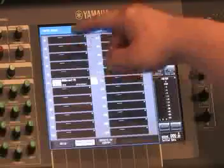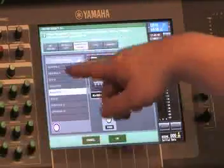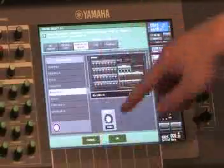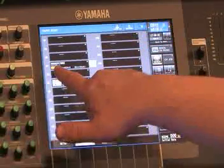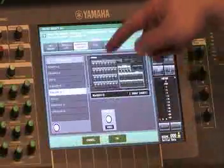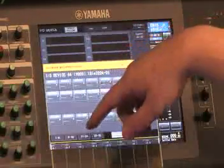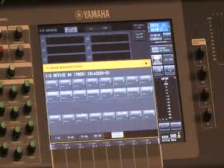I can also plan ahead. If I know I'm going to put something on, like say Yamaha's 32-channel Rio — which is their input device for these consoles — I can choose its ID number and say put that in slot 3. This shows as a virtual unit because it hasn't been plugged into the network yet, but if I plug it in and it's set right, I can go into this unit and it dictates its outputs and inputs and how these are routed into the Dante network, without even having the unit plugged in.